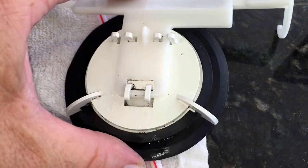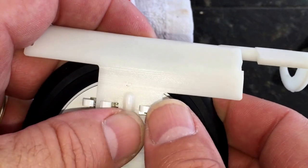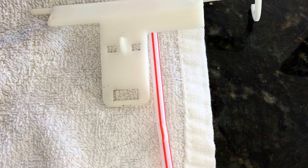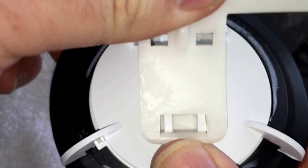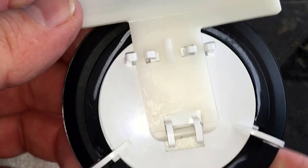The spring was actually broken on this fridge, so that's a new spring. On the flapper door we're going to replace the flapper but the arm piece gets reused. We pry these little pins apart until you can pull the top out and the bottom just pops up from under there. Then we get the new one and put it in the same way. There's the new one and the part number. The old one, if you look at the back, was not quite flat anymore so cold air could leak out the bottom, which would help freeze up the water dispensing hose. We pop the bottom under, snap it down, and this is ready to go back in.